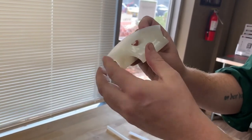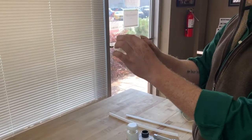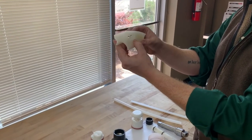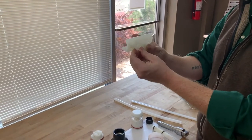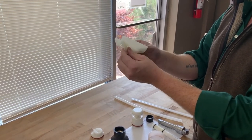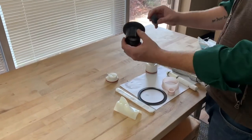So if you have a Stoelting, these are blades you would want to check to make sure there are no nicks again. You want to make sure that the wear line isn't there and that your springs are fresh, because on the Stoelting machine, the springs help keep tension. These are really great blades. One of the great things Stoelting does is this blade set, while it's a little tough to assemble, really does a good job.